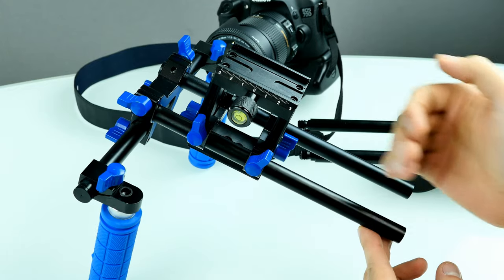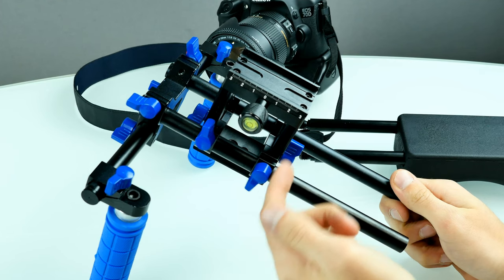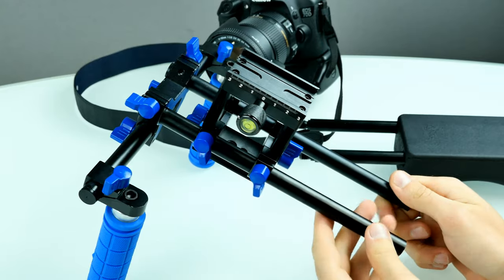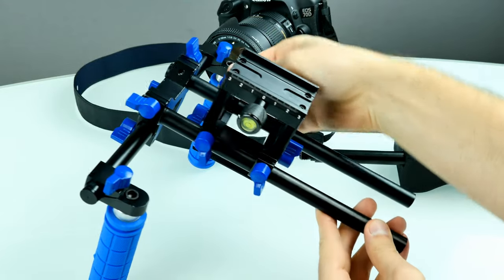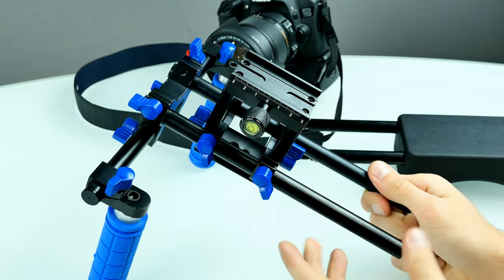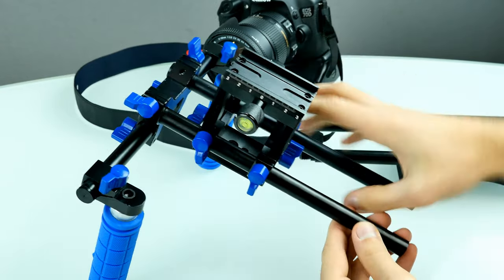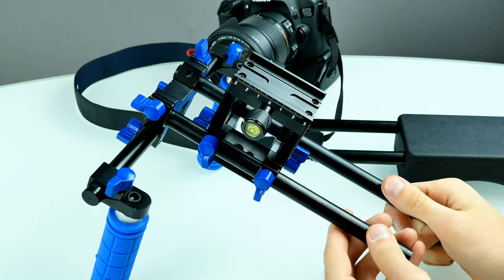To adjust the rail block, you have to unscrew the quick mounts — basically some screws you can unscrew with your bare hands, so no tools are needed. That's really great. The quality could be a little bit better; I'm not really sure how durable it is. The only bad thing is that it really gets stuck sometimes on the rails and isn't very smooth. It probably could use some kind of sliding pads or bearings on the inside, because moving it back takes a lot of effort even when all the screws are unscrewed.